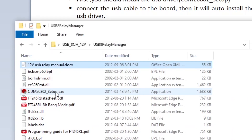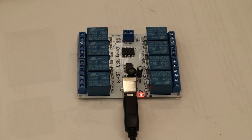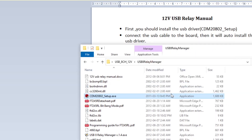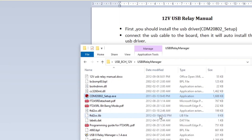So let's install the USB driver. There's a little setup.exe right here — click on that, say yes. It's saying it might not have installed correctly, so I'm going to plug in the USB cable and see if it auto-installs. I just plugged in the USB and it did not do anything. So either it did not install correctly or maybe it's waiting for this to be closed. I'll try running it as 'program installed correctly' and see what happens. I'm going to unplug and re-plug the USB cable — and I did not get anything pop up. So I'm going to redo this and try running it in compatibility mode. And there we go — installing driver. Perfect, that looks like it worked.